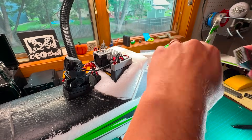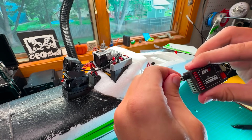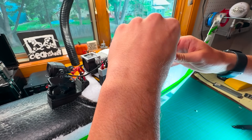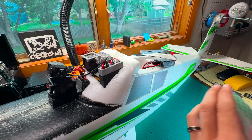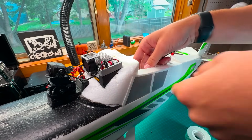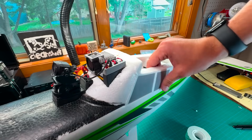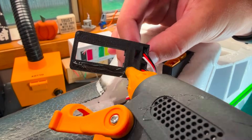This is also a cook's choice situation — I added an eight-channel ELRS receiver, which is totally overkill. I'm only using three channels to control pan, tilt, and the on/off switch, so a small four-channel Spektrum receiver is all you really need. But I had a spare one, so I plugged in the pan and tilt servos, connected it to the receiver, added a little double-sided tape on the back, and stuck it to the side of the canopy. It gets power from that board we already showed and it's a really easy install — also super easy to swap between different builds.